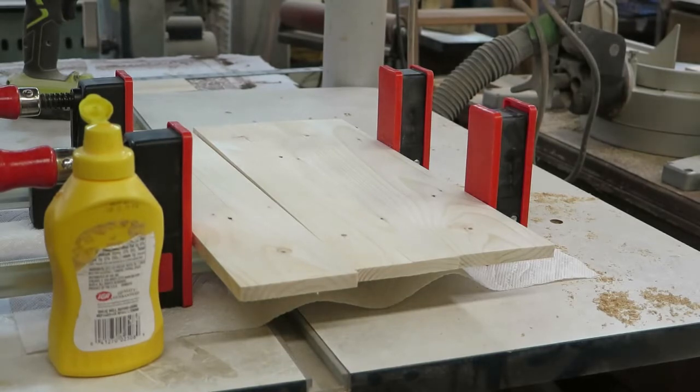Okay, I've cut those strips out of the 2x4, brought it down to three of them. I ran it through the table saw again on the edges to straighten out all the edges. And of course I ran them through the planer so that they'd be very close in size. Now after we get this thing glued up and it's dried, we can give it one final pass through the planer to make sure everything is nice and smooth. Again, it doesn't really matter if you have knot holes in it and things like that, as to the effect of this old sign that we're trying to make.